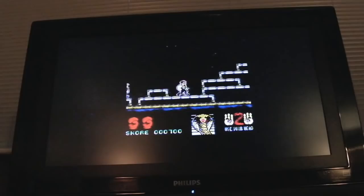Yeah, the interesting thing is, it's the same as the other side of the disc, in that two of the games work, the first ones, the other ones don't. It could be that it's messed the heads up again. That's one possibility. You know, you put a new disc in, you may have to clean your heads. I did find that on the CPC and on this one, actually. You test with one disc, it works right, you put a disc in, suddenly no discs are working, you clean the heads again, both discs work. So that's something to bear in mind.